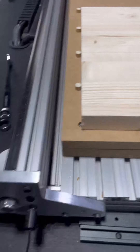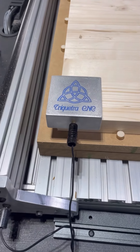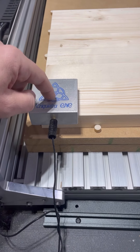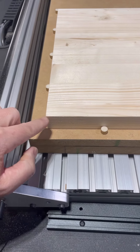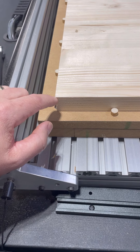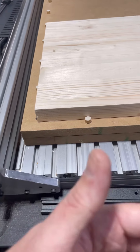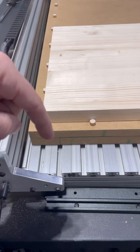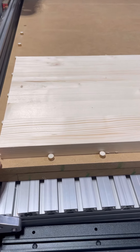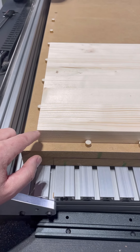The other thing I do is use this little corner probe — it fits perfectly on this corner. I zero my Z here and set my XY to this corner in Easel. For every carve I just reuse the previous XY unless I need to change it, like if I'm doing a circle and want to carve in the middle. But if I'm doing something like a rectangle, square, or piece of plywood where I know I'm starting in the corner, I don't ever change my XY in Easel — it's the same thing over and over again.